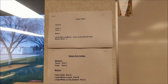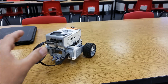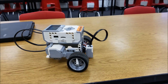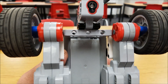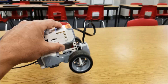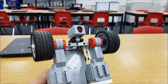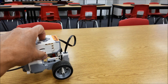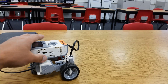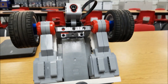That is a huge percentage of the problem — still the cables. But with a project, they have to check to make sure their cables are in the right spot. Depending on the robot you're building, a low percentage of problems occur with something silly. One year I had students put their two wheels on a single axle and then ask me how come their robot doesn't turn. It took us a while to figure out that it wasn't turning because when one wheel wanted to go forward and the other wanted to go backwards, it can't do that on a single axle. We actually had to turn the robot over to figure out there's your problem with the axles.